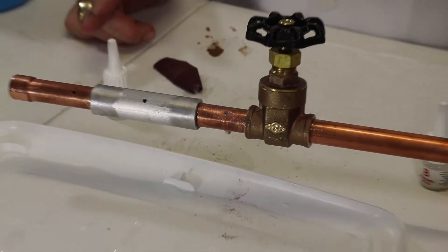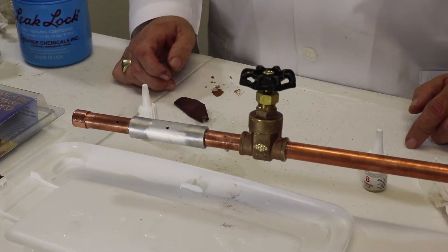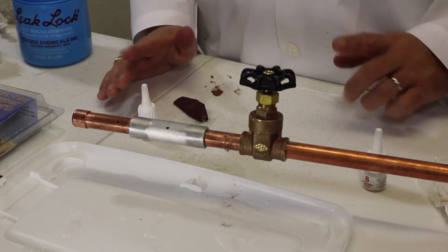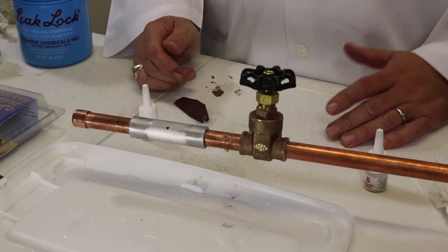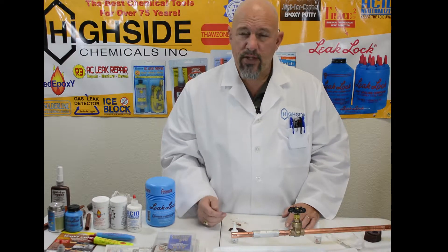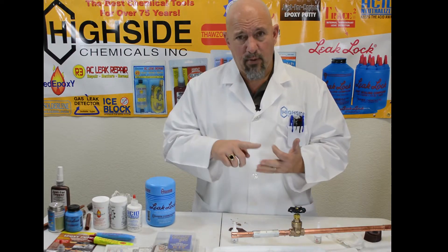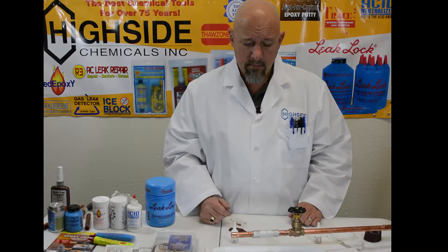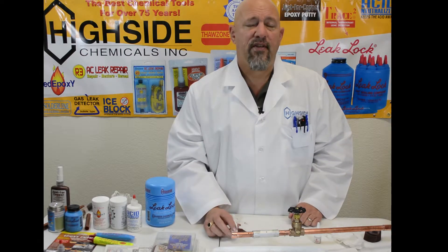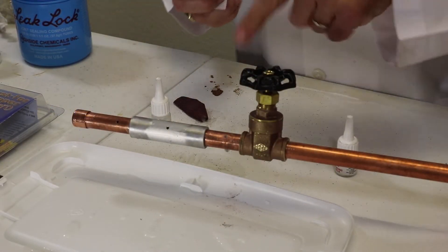And in 20 minutes, you'll have a 1800 PSI bond. So whatever pressures you're running through this, they can definitely be handled by this bond. The two materials have an affinity for one another. This is a new technology. It can be used on aluminum, copper, brass, steel, stainless steel, PEX — any hard substrate. When finished, it will have a Shore D rating of 85, which is just shy of glass. The hardness of this repair is going to be unmatched by just about anything else on the market.